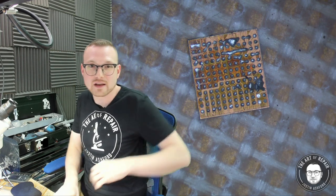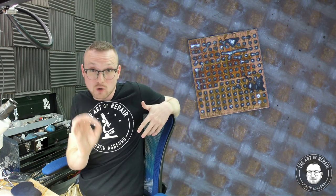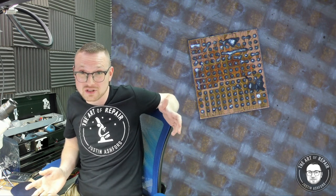The first thing we see is that this chip still has a lot of other junk on it, and I think this scares a lot of people. If you're taking a chip off correctly, there really shouldn't be an issue as long as that IC chip wasn't damaged before. If you're replacing it because it was damaged, reballing won't fix it. Outside of that, you should be fine. Reballing lets you start harvesting chips from other boards instead of buying new chips for five or six dollars a piece — this video is going to pay for itself.